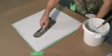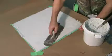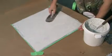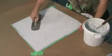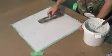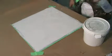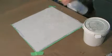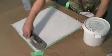Then press the face of the trowel onto the wet Versi-Plast and pull the trowel towards you. This will create tiny fossil-like fissures. The trick to getting the best surface appearance is to lightly spray the second coat with water after the fissures have been raised, then very lightly trowel over the Versi-Plast. Use an X pattern in troweling to avoid obvious directional strokes.